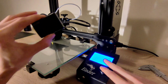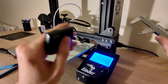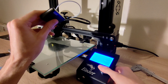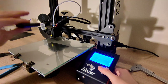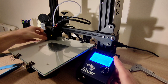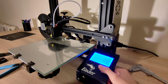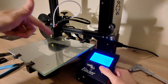I can use this same method with my lighter. The main thing is to know the thickness of the object — as I measured, this lighter was 13 millimeters. So if you're using something other than the Creality scraper, just move your Z-axis to that height and use that object to level your bed. The printer then thinks it's 13mm away from the bed, so when you place something 13mm thick under it, you know the nozzle is in the correct position. You can use anything — even paper — just consider that paper is approximately 0.1mm thick. Make sure your bed is clean and don't touch it with your fingers, because grease can ruin your adhesion.